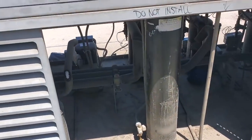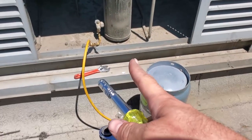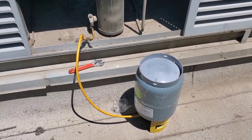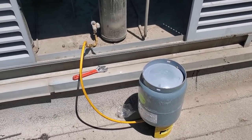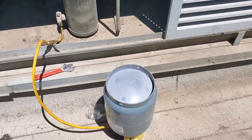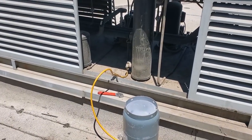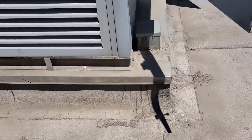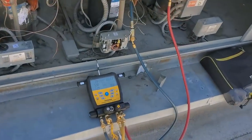So I don't know if it's overcharged or if it's because it's a dirty condenser, cause the condenser is a little dirty. So I hooked up this hose while it was pumping down and let it shoot some refrigerant into that recovery cylinder as a liquid, so that way if it is overcharged — which is my theory — it pumped out liquid refrigerant into there. I'll test the charge once we turn the system back on. Quite a bit went into that tank. So now we're going to go downstairs and do a hot swap on these power heads, because I didn't want to have to change the dryer and vacuum the system down. So we just pumped it down to about just under 10 PSI, and I'm going to change those power heads under pressure at about 7.9 PSI.